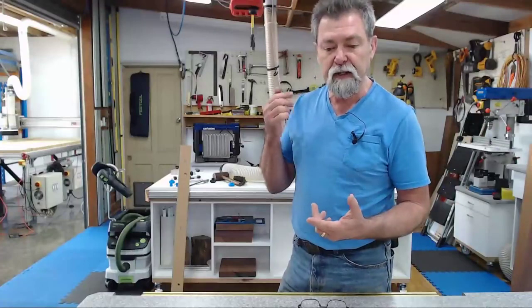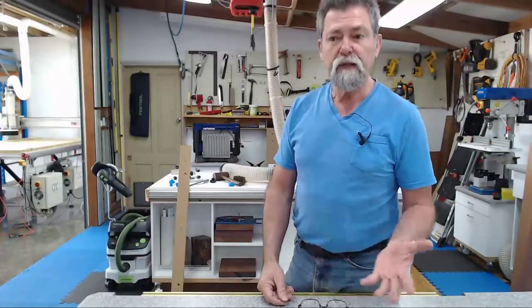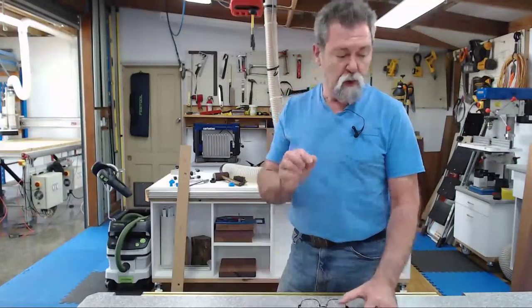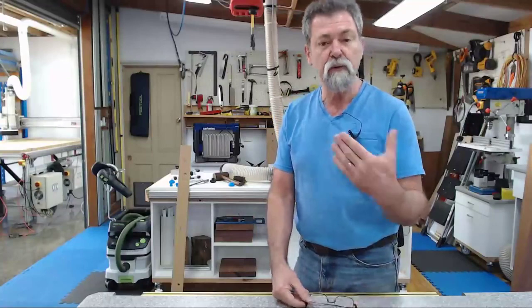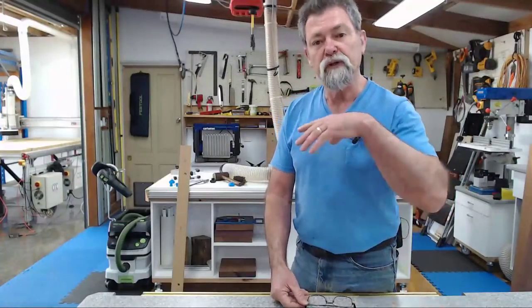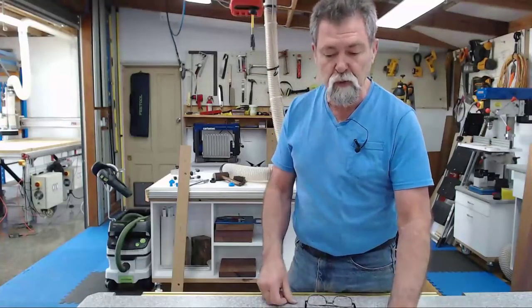Now I'm going to either supply it in MDF or marine ply or maybe something around. It's got to be around about a minimum of 18 millimeters for all the dogs to work. So I want it to be able to work with TSO's dogs. I want it to work with Peter Parfitt's dogs. I want it to work with John from Yellow Box Shed. I want it to work with his dogs as well.